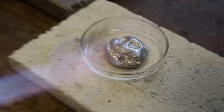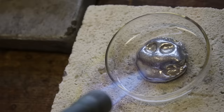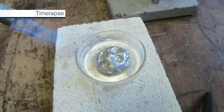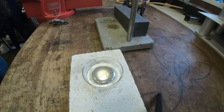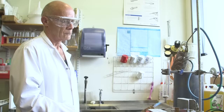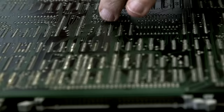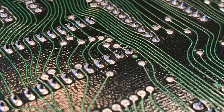One of the interesting things about tin is that it melts at quite a low temperature — around 230 degrees centigrade. So even with a gas torch, you can melt it quite easily in a glass test tube. This low melting point is very useful for a whole series of applications, particularly for so-called solder, which is the metal used to make electrical connections — in this case on a very old computer memory board.